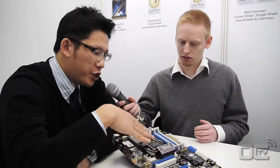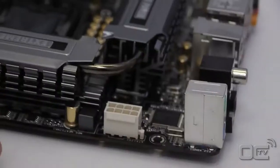Is there anything further you'd like to tell us about? Because of the new P67 chipset architecture, the overclocking margin is limited by the Intel chipset, so we're more focused on USB 3 performance now. We have a new technology called X-Fast USB, which can improve USB speed a lot — not only USB 3 but also USB 2. According to our test results on the P67 platform, USB 3 can improve by maybe 97%, and USB 2 performance can be boosted three to four times — about 350% — faster. We put more focus on this with dedicated software called X-Fast USB.